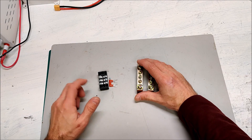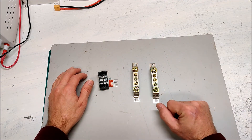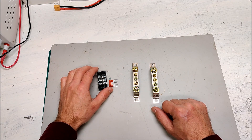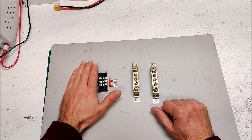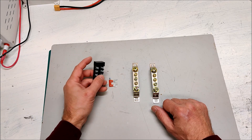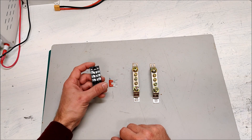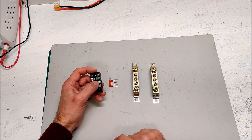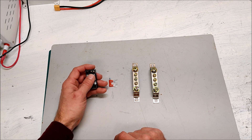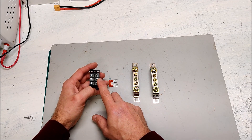I ordered some new busbars for my LiFePO4 15 kilowatt power wall — it's over in the corner of my garage and it works great. But in a previous video I had problems where I used undersized wiring for the solar, purely by mistake. Also, the terminal block I was running the solar into and back out to the battery was getting hot. I rigged it with some copper links and it's perfectly cool now, but it's probably undersized for the current.